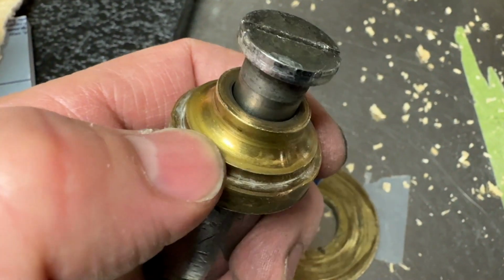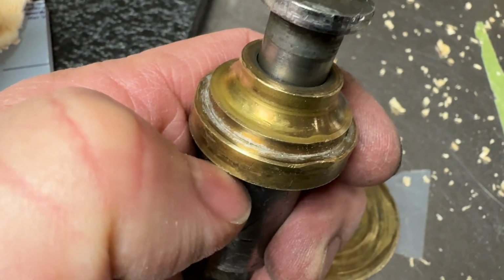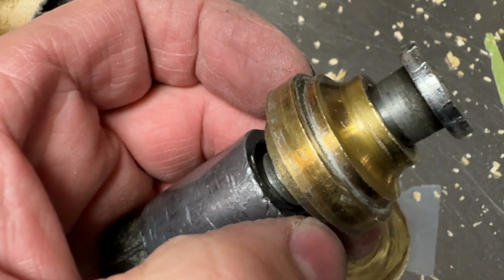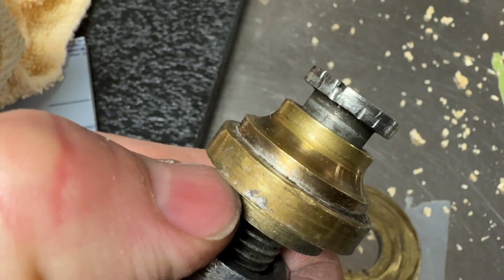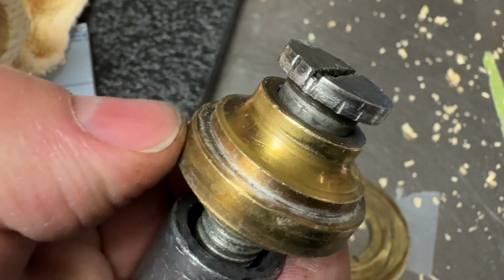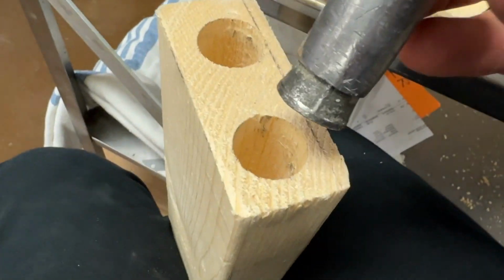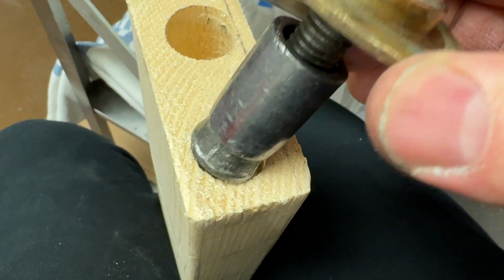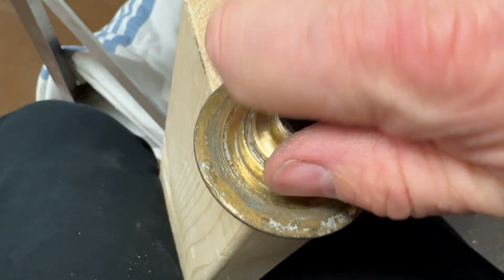This component here is the surface where the thrust bearing ball elements roll. This could be easily remade by a competent machinist or millwright in their first year of their apprenticeship, seriously, but it does need a chunk of metal it's originally made out of. How this works is very, very straightforward. You drop all this into the floor, a correctly sized hole, 7/8 of an inch here. That's a little too big, so it drops in, and tighten the bolt.